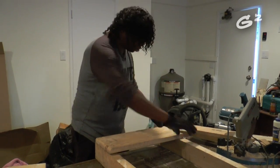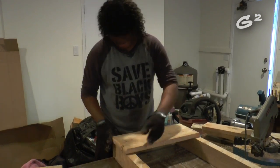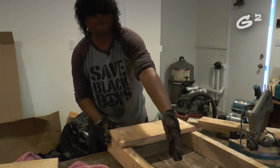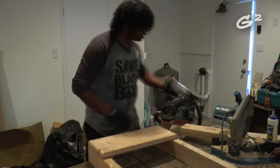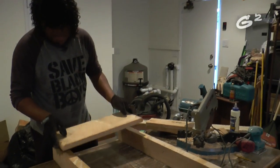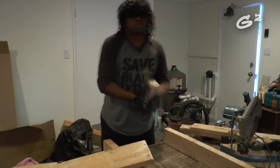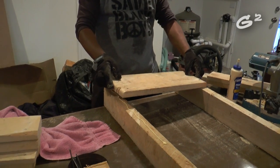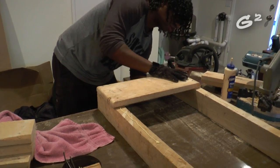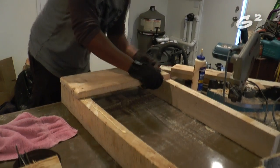You ain't got to be special, you just got to get it up there. So we line this up a little bit and then we're going to plank them all the way down. We're going to get the nail gun out. Actually, since I'm going to have this for a little time, I think I'm going to put some glue on here to make sure it's going to last. Now you always put a strip of glue — not much, just a little bit to hold it on there. Because the nails just introduce the work to it. The glue is what's doing the work up in here. Push it down real good and drive a couple in.